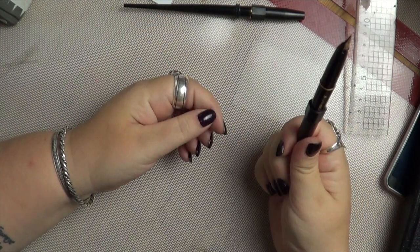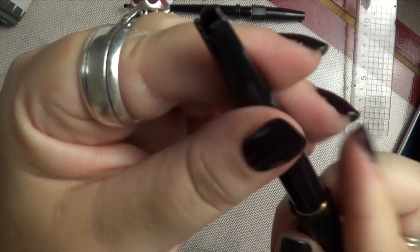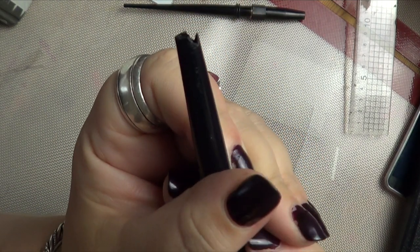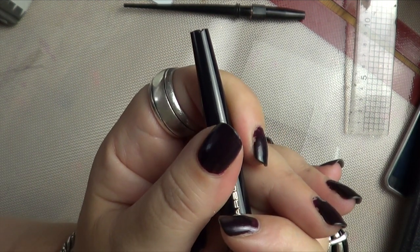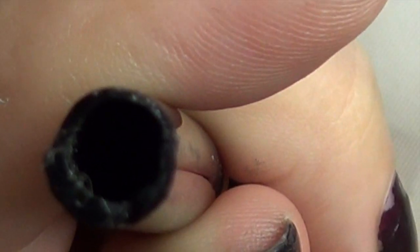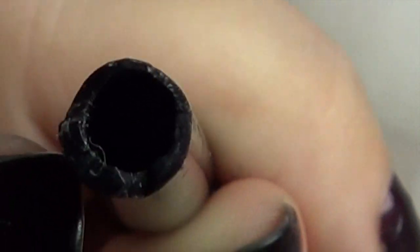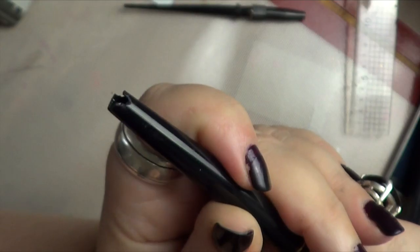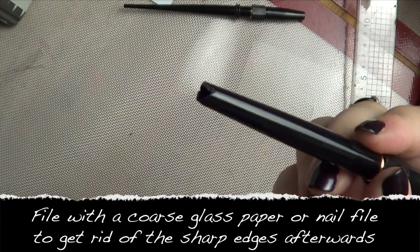So that solves several of the problems of this pen in one go. Now, this is what you need to be careful of — this was the first one I did. You can see there, a big chip came out of it. This side was absolutely fine, but when I got to this side — the thin side of the pen is actually much thinner than the other side. The thick side cut really nicely, but when I got to the thin side, it shattered. You have to be careful of that. But if I'd taped it first, that would have stopped that happening.